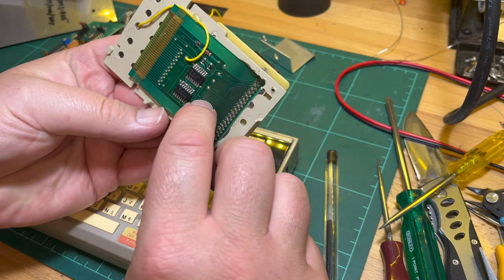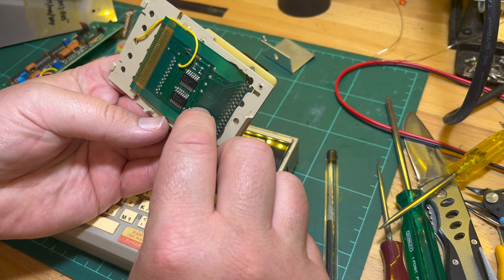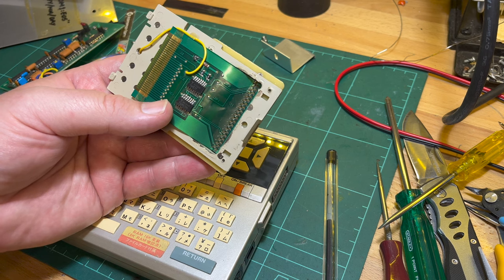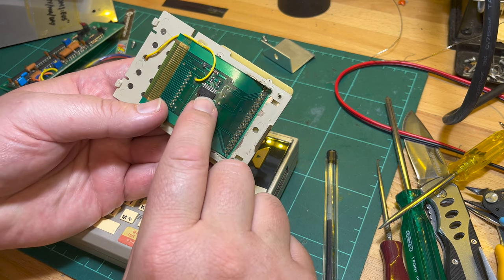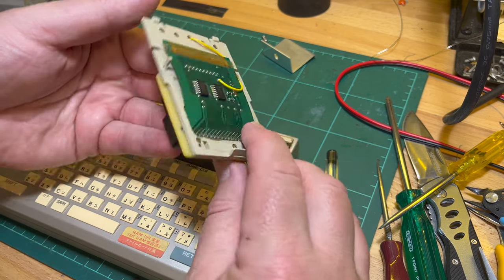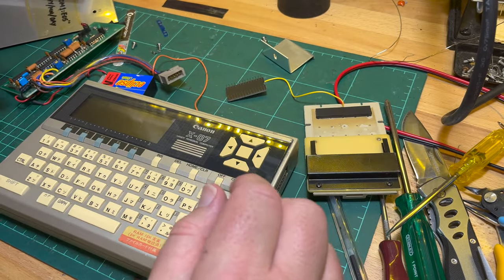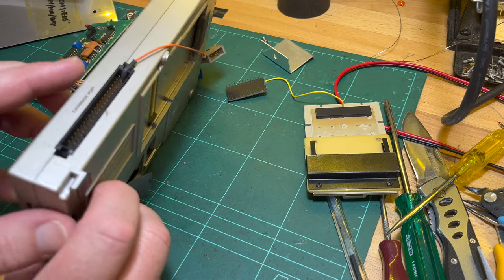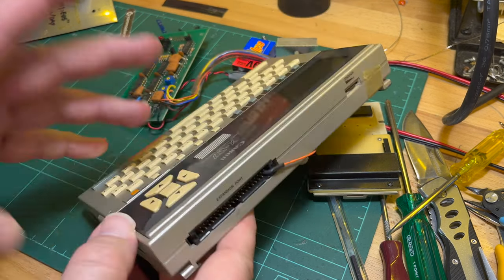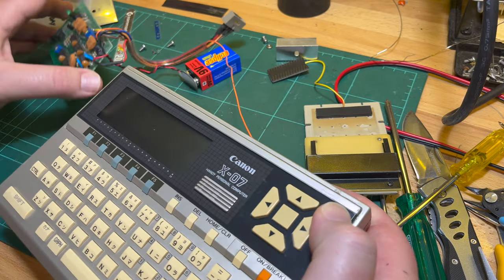And these two, so we've got a 74HC11, was it? Yeah. So that's, what's that? Triple three input AND gates and just inverting buffers there. So I'm guessing that the ROM cards went in there. So I've got this right, that's pin 39 on expansion, which is VCC2. So, okay, makes sense, I guess, maybe.